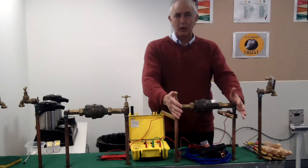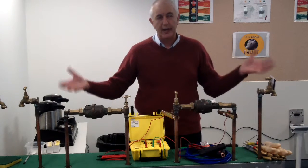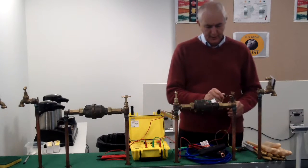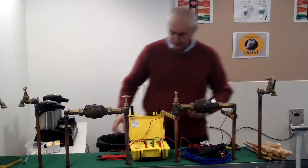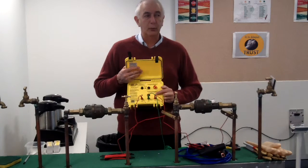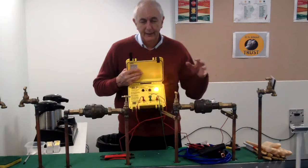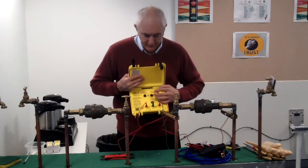While the PlumGuard is monitoring that job, if any dangerous voltages come onto that pipe — even from an intermittent fault somewhere in a house — the PlumGuard will alarm and tell you what has happened. I'm going to simulate that with a small battery. The alarm will go off, and the small LED will tell you on which side of the connection the fault is. If both lights are on, the whole area is alive. The PlumGuard won't stop until we turn it off, so it will remain in alarm until manually turned off.